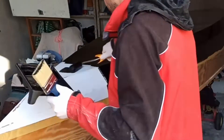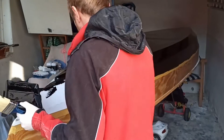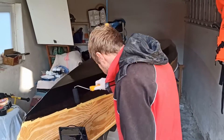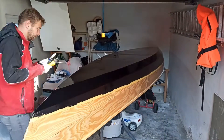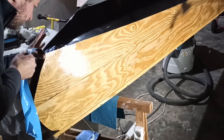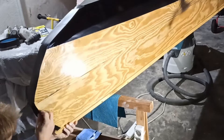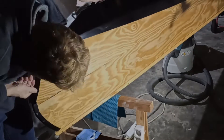After that I cleaned it with epoxy primer thinner. Then it was time to apply the two-component PU paint, and here again I used the roll and tip method. After I applied the second and last layer of PU paint, I removed the masking tape directly. After the paint had hardened completely, I taped a keel guard tape to the lower edges of the hull to protect it from sharp stones and other obstacles in the water.